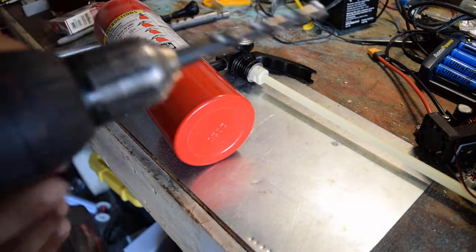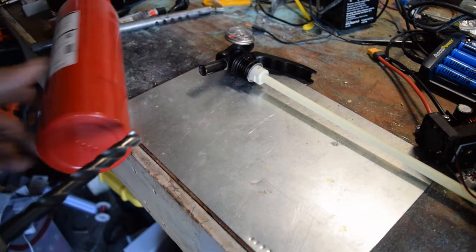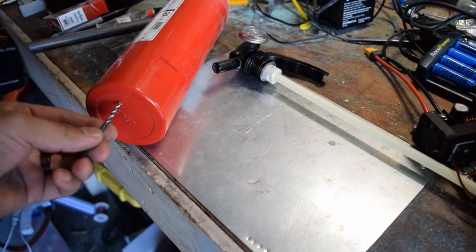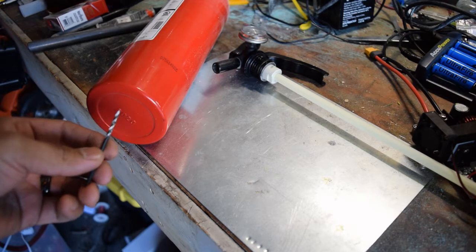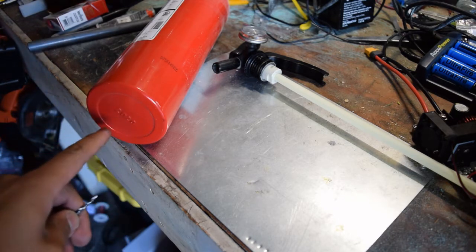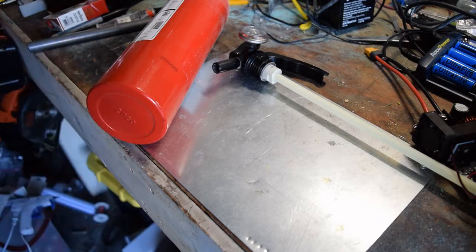You got a drill bit set. You got the 1/2 inch. You've also got the little ones. So what we're going to do is actually poke through with the little one and then use the big one afterwards. That way your drill isn't walking around the workpiece, and it's a little bit safer.